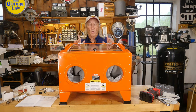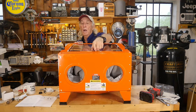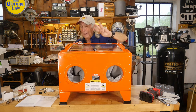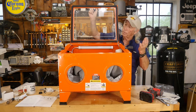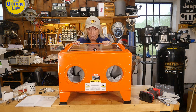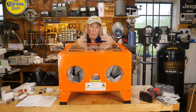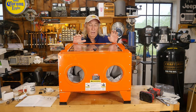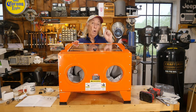There are some features here that are actually better than the Atlas. You also get several different tips for your gun, which is typical of these machines. They've also got this window taped into a window, and you get three extra shield replacements, because over time you're gonna tear all this up with the blast. What really goes in here is called media — do not go down to the beach and get a couple buckets of sand. I'll leave an affiliate link in the description for the media I use, because I quickly found this bench model likes the fine stuff.